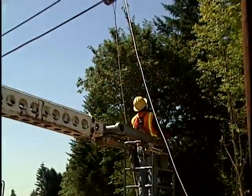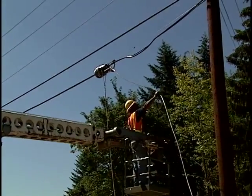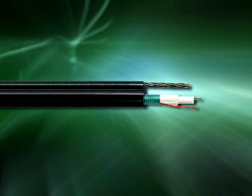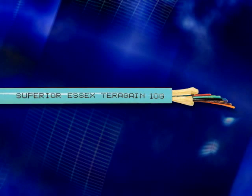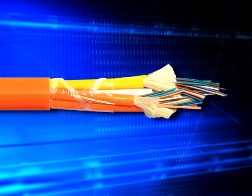The final phase of fiber cable production is the jacketing process. The materials used for the outer cable jacket are chosen for the intended application. For most OSP fiber cables, Superior Essex utilizes medium density polyethylene due to its durability, moisture resistance, and low coefficient of friction. High or low density polyethylene can also be used for select OSP cable designs requiring different performance characteristics. Polyvinyl chloride, or PVC, is typically used for premises cable designs. PVC is a thermoplastic with good flame and abrasion resistance, making it suitable for raceways, indoor-outdoor cable structures, ducted environments, and most riser-rated and plenum-rated locations.